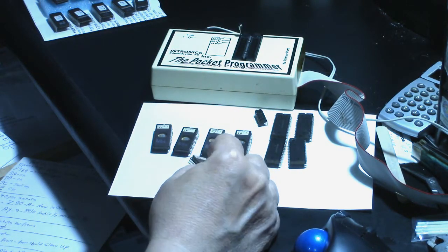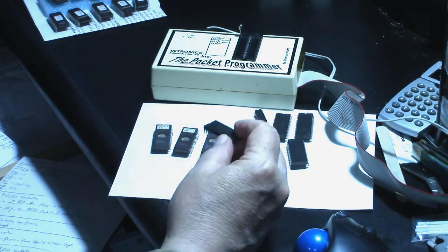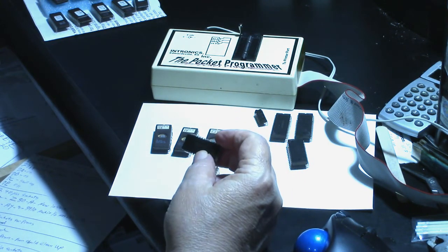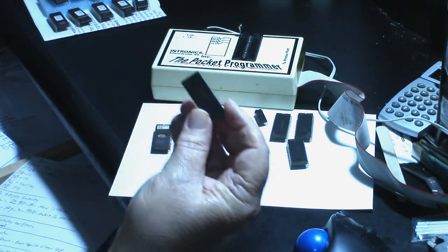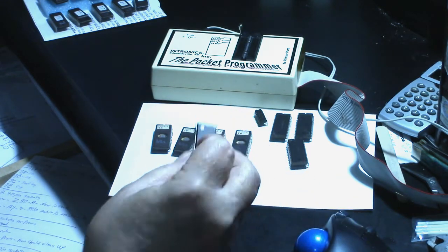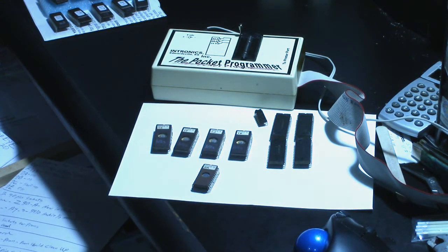The ROM, I'll get to the ROMs in a minute. These 4 chips right here, I looked them up, and according to the manual, they're MB7063s, but these happen to be compatible, or basically the same thing as the N82S09N. And this is a bipolar RAM, so we have 4 of those on the board, and these are in excellent shape. Nice and shiny, no rust on them at all. So hopefully they're good, because I don't have any. But we'll try them. I'm not gonna try to get any unless we can determine they're bad.